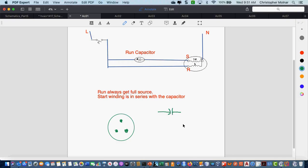And the reason you don't always see the dot anymore is because you just have to remember as a technician that if you don't see any switching devices, and I'll show you that in a few minutes, around the run capacitor, you know it's a run capacitor. If there's switching devices, and again, I'll show that to you in a minute, it's a start capacitor. I never know which to introduce first, capacitors or motors. So this time we're just introducing motors first. We'll get back to talking much more about capacitors. Sort of like the chicken or the egg, which came first.